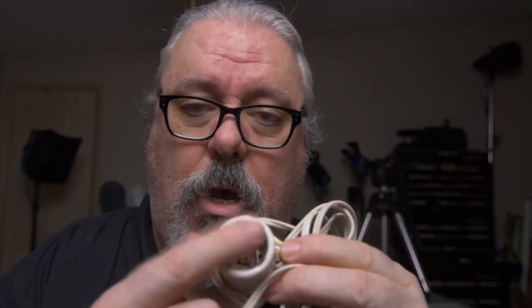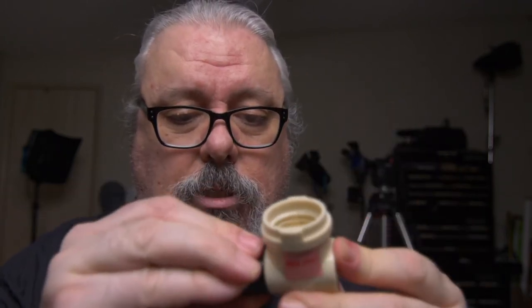We use these a lot with a particular gag: we frequently rig porcelain sockets like this one to accommodate photo flood bulbs, then give it a length of lamp cord and add a tap at the end. You use that to go into your socket adapter so you can keep everything tucked up high and out of the way — useful for supplementary bulbs in a chandelier rig, a kitchen, sci-fi spaceship sets, or anywhere you need access to power in a tucked-away place you couldn't run an actual power cable to.